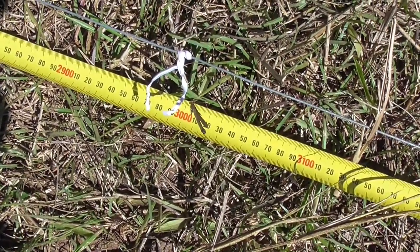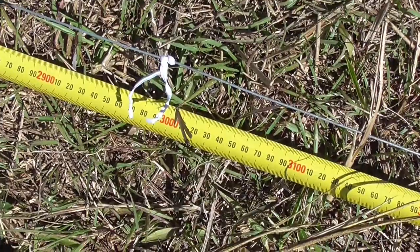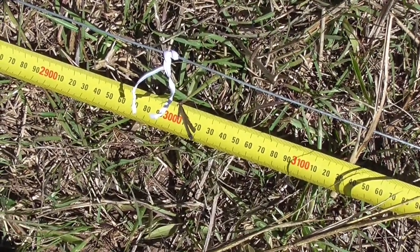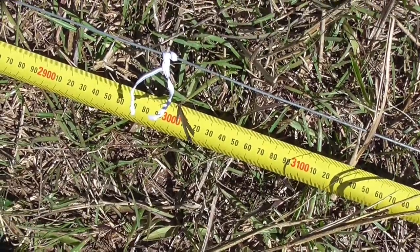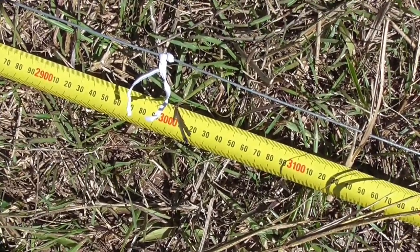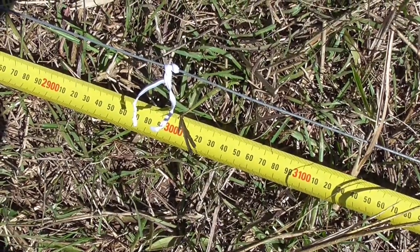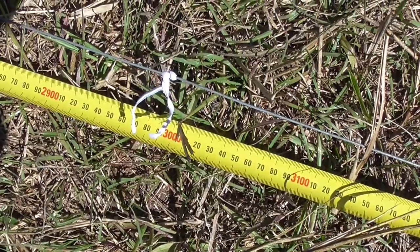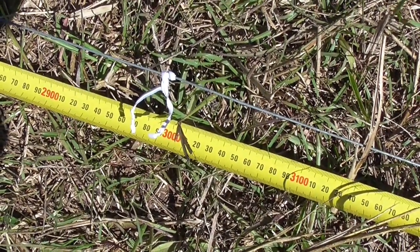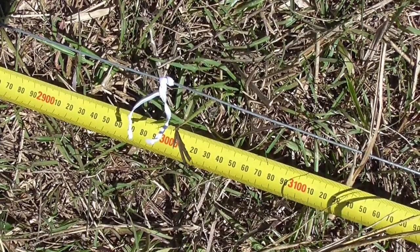What I've done here is I've got some twist ties — you know, the ones you used to get off bread, though they've got plastic clips now. I've put them on the wire accurately at 3 metres and 4 metres, and when the job's right it has to measure between those two points, where I've put those twist ties, exactly 5 metres. In this case because I've used 3, 4, and 5 metres.